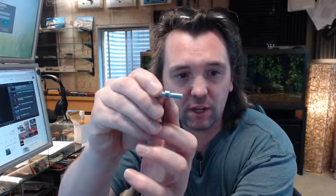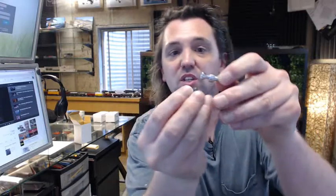The 1.5 inch comes from the underside of the head and the length of the threads. This is also going to include a set screw that will go in the base of the pull handle and lock into the underside of the cone like this.